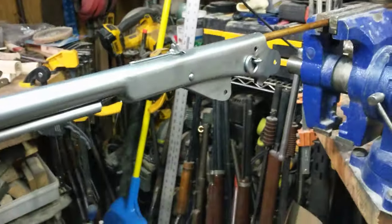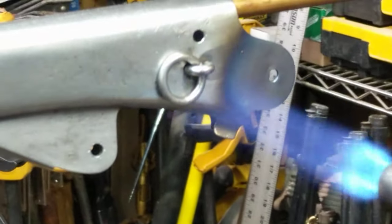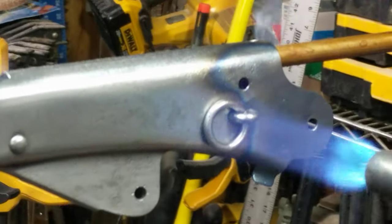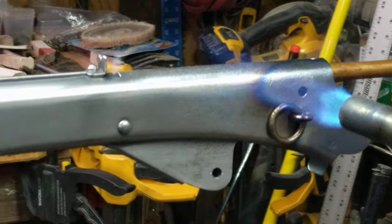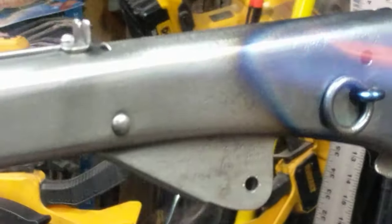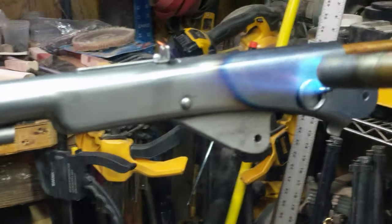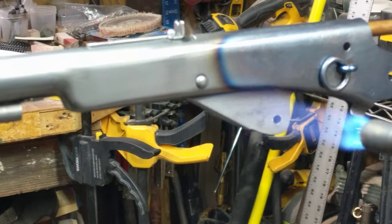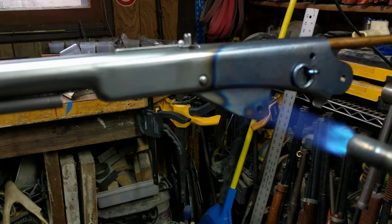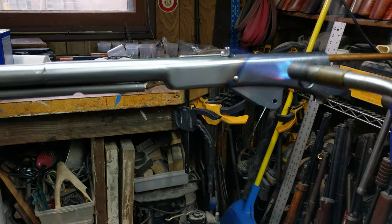This is how I do it. I like to pick a spot, get my torch on it, and watch for the change. There we go — a little bit of a color roll happening. It's completely normal for any leftover residue of oil or grease on the inside of that receiver to start smoking off. That's another reason why you always want to have some ventilation going on, especially if you're doing this indoors. See how that color roll starts? That's the oxide coat we're looking to put on the steel. Right now it's kind of a light blue, but as we get further along it'll darken. Eventually it'll go from a straw purple to a dark blue to a light blue, and then it's time to move on.